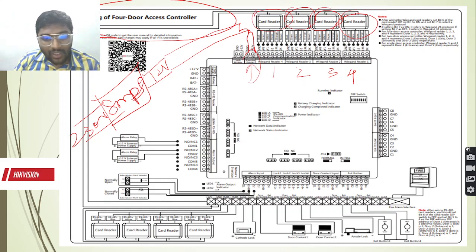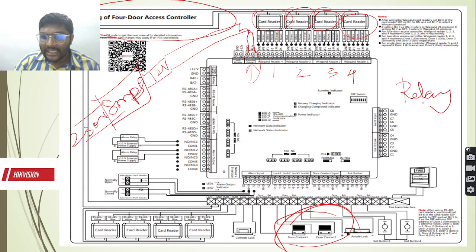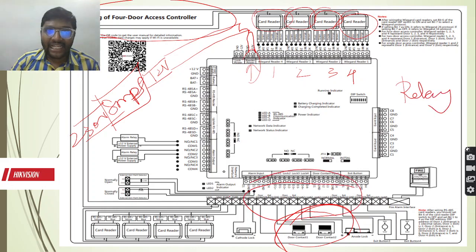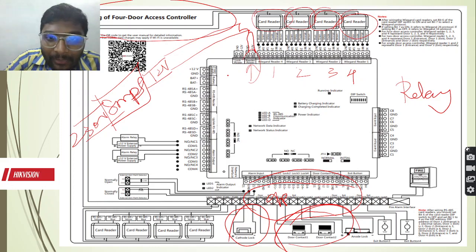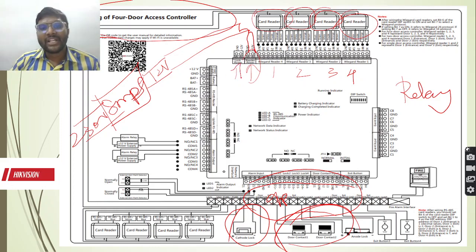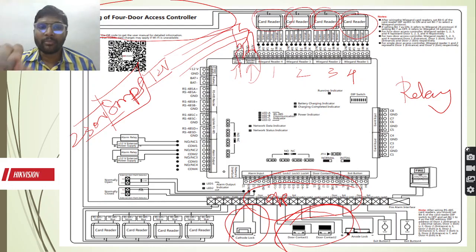We might be having some door contacts. If you want to command these door contacts, we need the help of relays. These are going to be the relays. For the locks, we also have lock power supply and lock command as outputs. For the door lock to operate it needs a power supply - this is going to be the lock power supply. So here also we need to connect a 12-volt supply. Either you can take a tap from here and connect it. This is one of the most important power wiring connections, and this is how you need to connect your output signals.